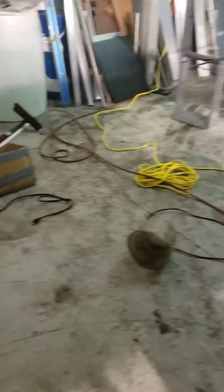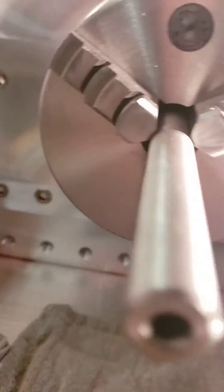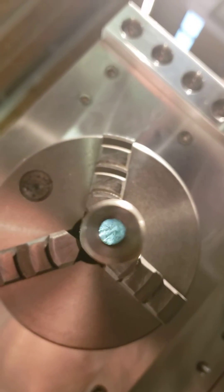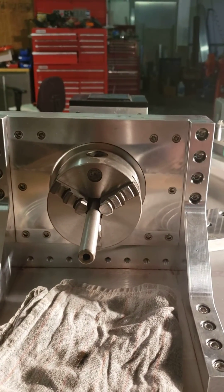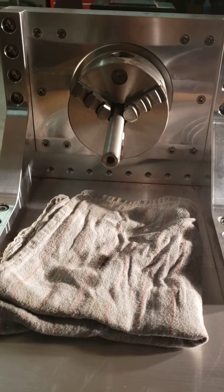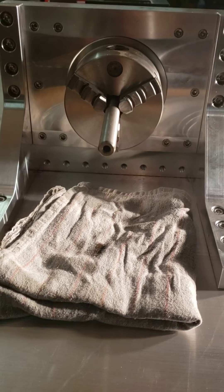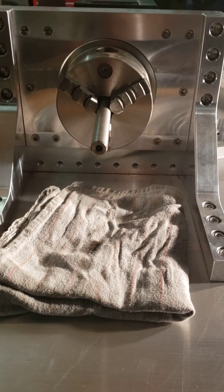Let's see if we can see in the barrel now — I don't think we have enough light. I'm going to put a flashlight up to it on the back side and see if we can see the rifling that's cut. It's very oily, but the shorter barrel that I did earlier had a great rifling finish, and it was initially drilled and then reamed to .2195, and then the rifling button pulls right through.